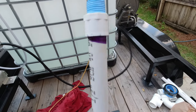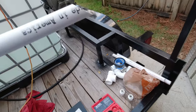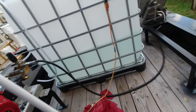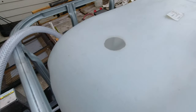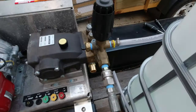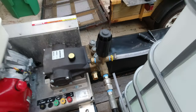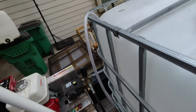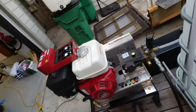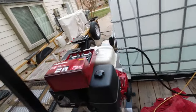Doing the bypass now. Got the half inch — I put tape on it; I probably didn't have to but I did. At the bottom of the bypass I made a little angle, and it's essentially going to go right in this hole here with a 90 degree. So my bypass is coming out the pressure washer — we'll swap the fittings around — go right here, very short run back into the tank. I put a drop tube just to avoid cavitation from any air bubbles.